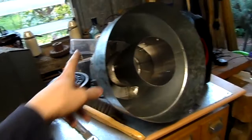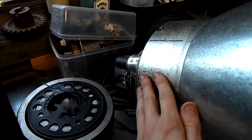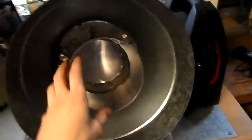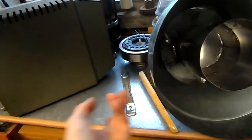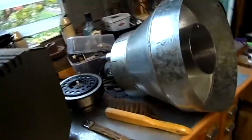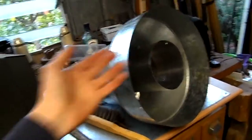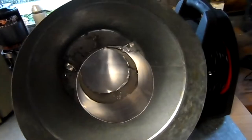So that's going to be my rotator, and then this is all going to mount on it, and then I'll work out a way to pump air to it because it's an old vac motor. It's going to work very similar to the way the Chrysler Sirens do. You've got a series of discs with the same number of perforations in them, and as they rotate past each other, that's how you're getting the pulsar effect, as opposed to the radial ones, which suck air in on their own and then blow it out, which is the most common type of siren that you'll see.